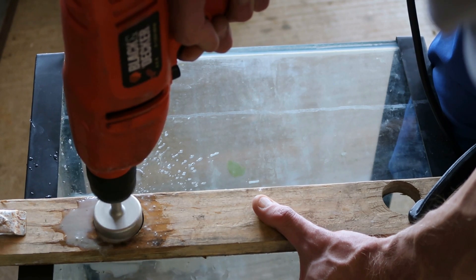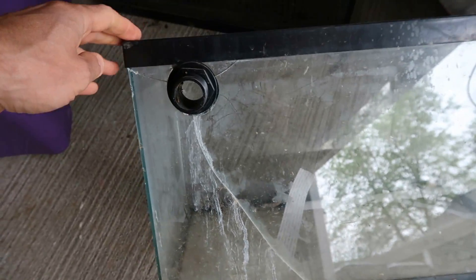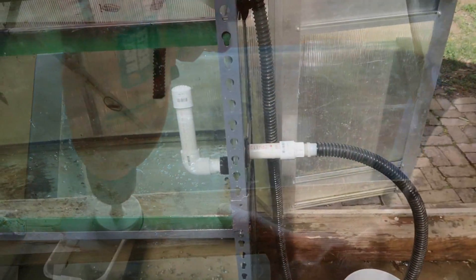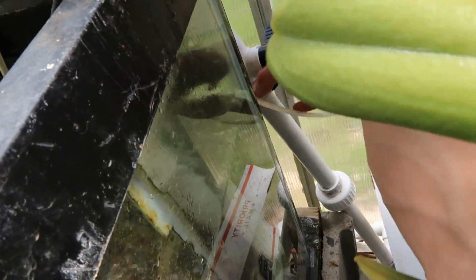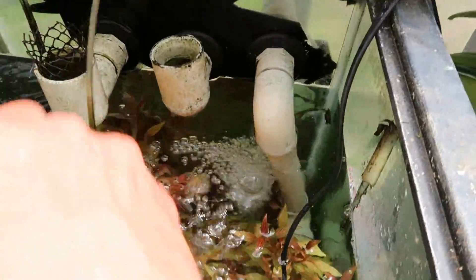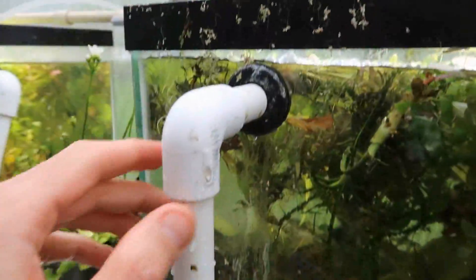Now we are getting ready to drill, but before you drill make sure you measure where your hole is going to be and look to see how closely the bulkhead will fit. I have drilled tanks too closely to the edge and cracked them trying to tighten up a bulkhead only to realize it was up against some trim. Now let's talk about bulkhead location. As I showed you last week, I'm running these in the middle of a tank or lower. If you have the right bulkhead, you can fit a pipe on either side and use an elbow inside the tank. The added benefit is that if something happens to your fitting and your tank starts to drain, it will only drain down to the level of the hole.